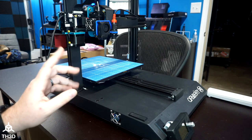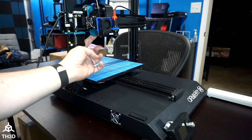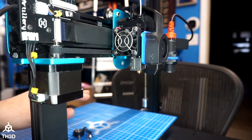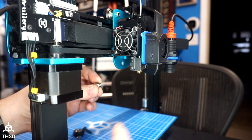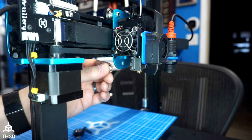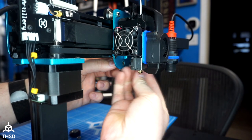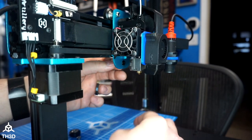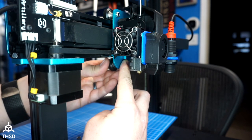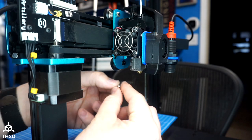Now that our cable work is done, we need to put the wheel back on along with its bolt, eccentric nut, and washer. When putting this back on, make sure everything goes in the correct order. The first thing to go on is the eccentric nut — it has a little round part that needs to go towards the back plate. Put that back in, then put the bolt back through. Next, put the brass washer back on, then the wheel, and finally the nylon lock nut.